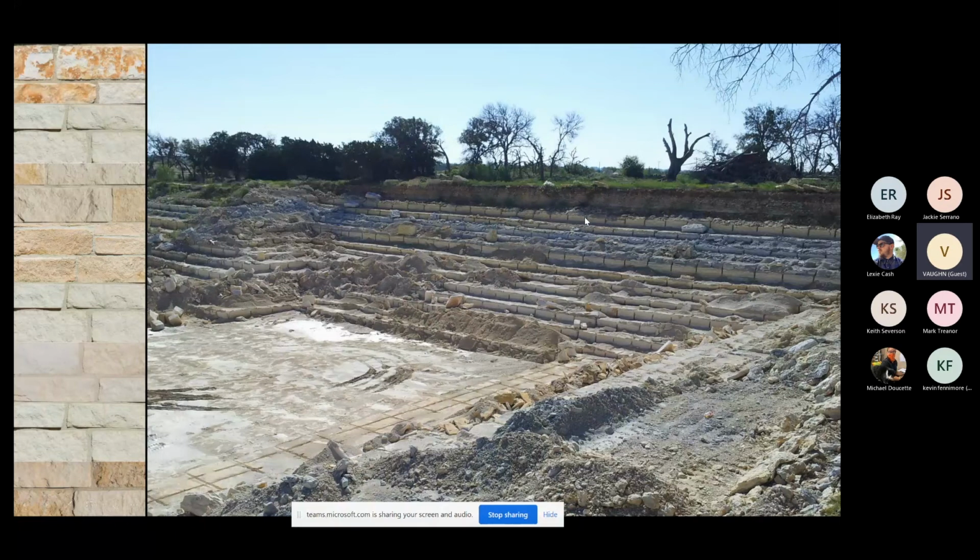Next rock down, you're going to see a block ledge, a ledge, and then this blue. All of this is useless limestone. It has not been compressed with time. It has all kinds of little seams and dry lines that are very loose. These blocks are usable, but not for building stone. This is what we would take over to a separate part of the quarry, and we would take it to a crusher to create road base.